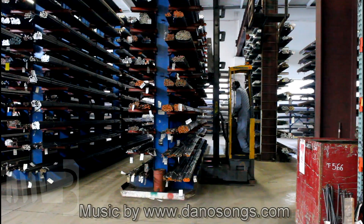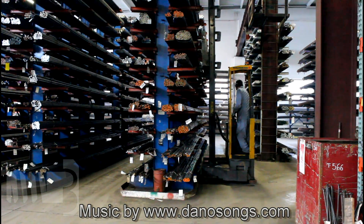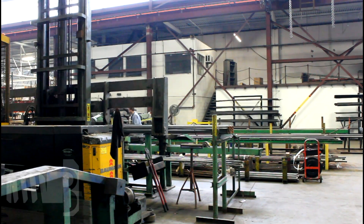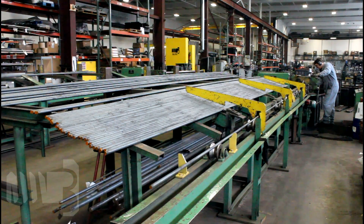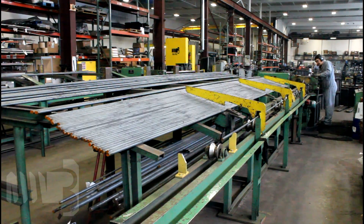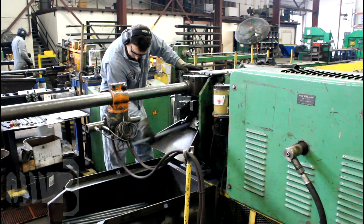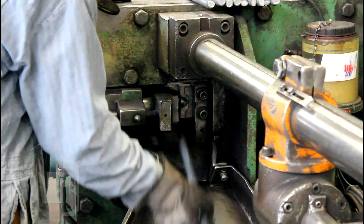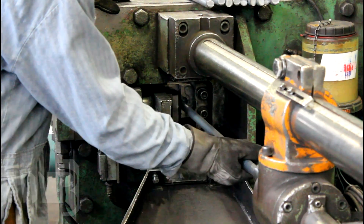The square head machine bolts for this order are manufactured from A36 mild steel round bar, which we receive in 20 foot lengths from a steel mill in McMinnville, Oregon. After the steel is removed from the racks, the first step in the manufacturing process is cutting the bars of steel to length. This is done on one of our shears, which chops the steel like a guillotine — a fast and efficient method of cutting.